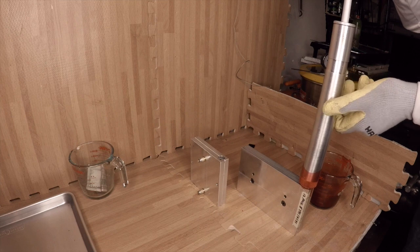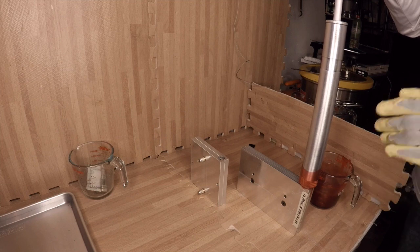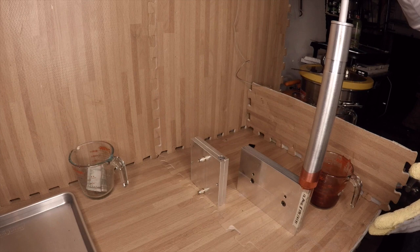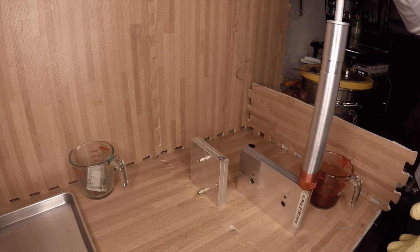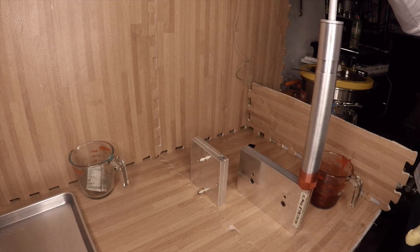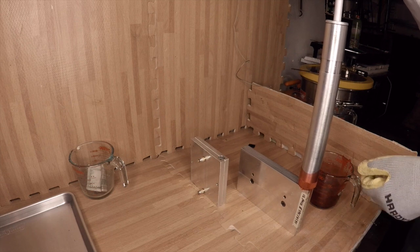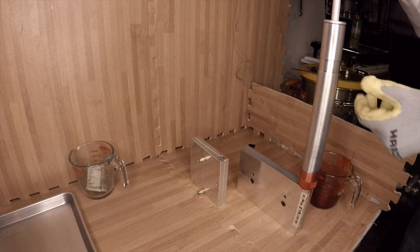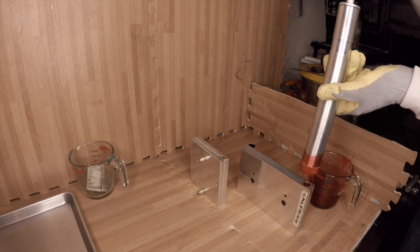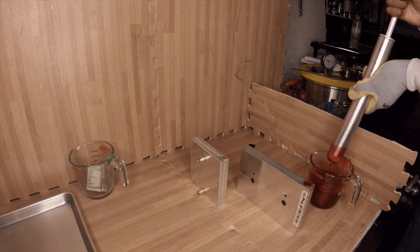Now, because it's at 350, I'm not gonna push hard because I know that if I push hard, I'm gonna get flashing. So just enough pressure to shoot all the way through. Hopefully it'll make sure that I don't have any air in the tail areas on the de-finesse, but I really didn't want to add a lot of pressure to it because it flowed through very easily, and I know any excessive force that I pushed down on it would have caused us to get flashing. So again, I'm going to hold pressure for about 20-25 seconds, let up, and then I'll top off my sprue, put my excess back in the cup.